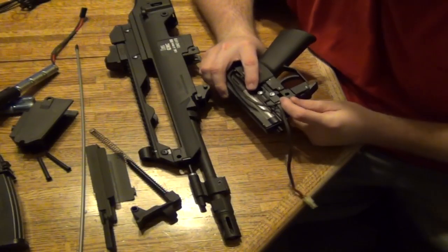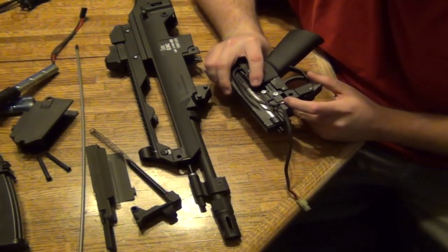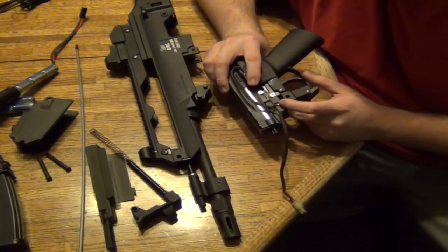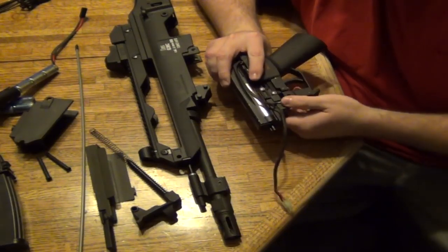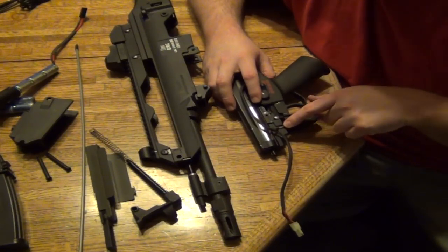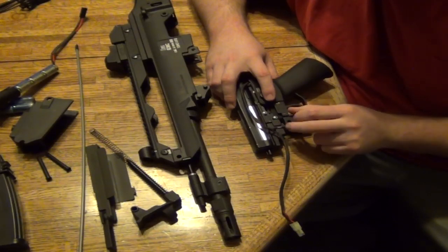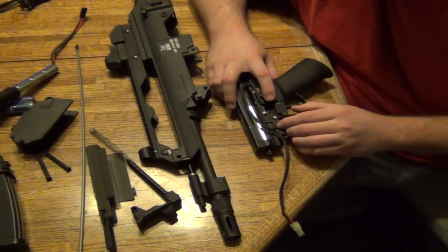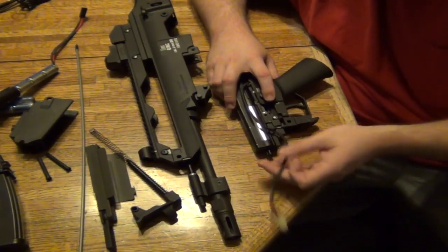You want to be able to make a good solder joint. Watch some soldering videos to learn how to make a good solder because you don't want to make a poor one where it just comes off. A good trick is to heat up both the wire and the solder together at that location so it sticks well. Usually people just heat up the solder and let it fall on — that's not a good way to do it.